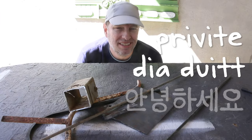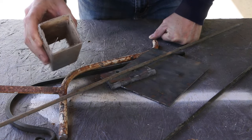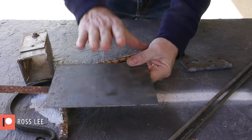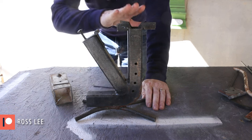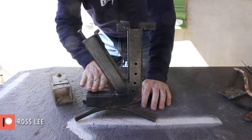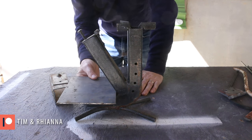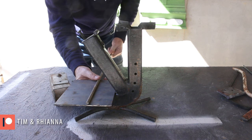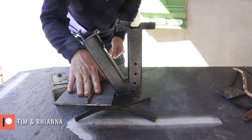So today I'm gonna make a J-tube rocket stove with this 2-inch box tube. And I wanna use this flat piece of steel to make a grill over the fire tunnel. Normally with a rocket stove, you cook on the top with the fire coming out here. But I actually wanna cook on this section, the fire tunnel. And I'm gonna do that with a grill like this. I'm gonna use some round stock here to raise up sections of my grill to make it a grill versus a griddle. And my goal is to have a nice steady heat.